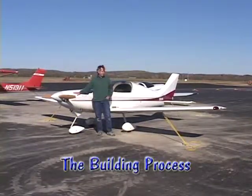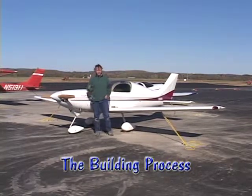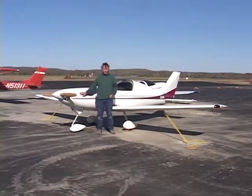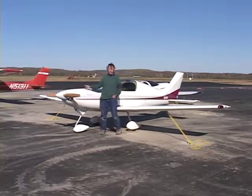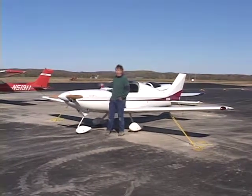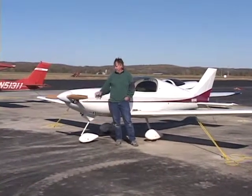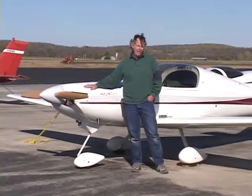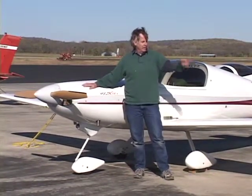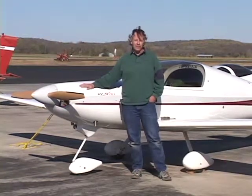It's pretty straightforward. The manual is easy to understand. It's an all-fiberglass airplane. The fuselage comes in two halves split the long way, and you put that together, then you have to build on the cowlings, mount the engine, build the instrument panel, sand and paint. You have to build the wings. It's a pretty easy thing to do — it's just time-consuming.